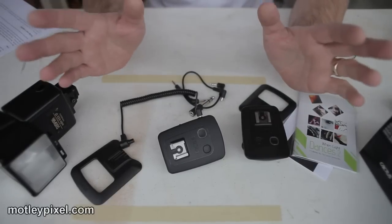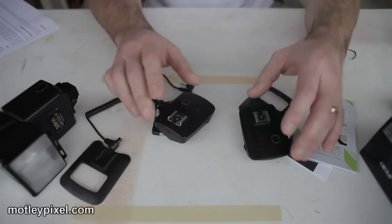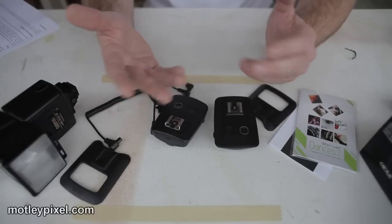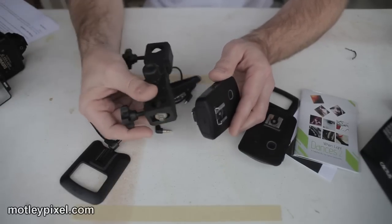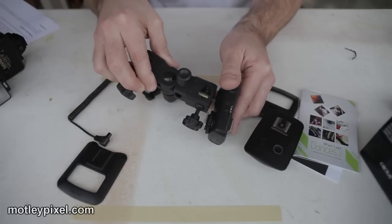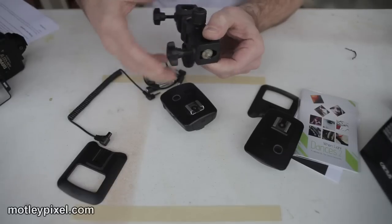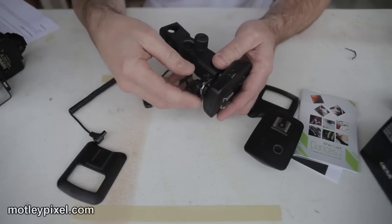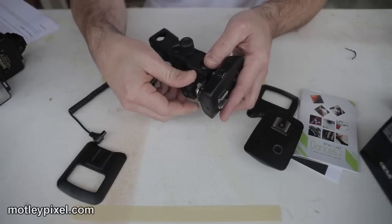Now that I've said so many positive things, you're probably asking — well, there's got to be something that's not so good. As with everything, there are always some cons. In this case, I feel it's very minor because it's easily workable. The main thing most people discovered is the use of an umbrella swivel and how the unit mounts to it — because of this location, the male hot shoe interferes with the spigot nut. The way I work around it is to take the spigot out, screw it into the transceiver first, then put it into the swivel and lift it up slightly before tightening it down snugly.